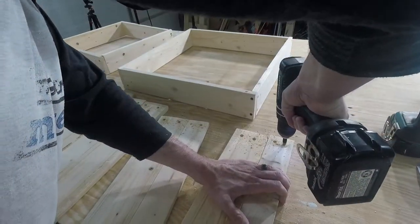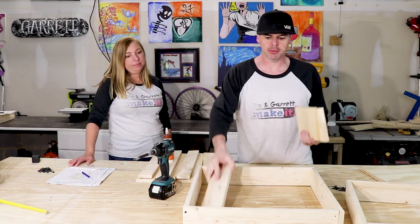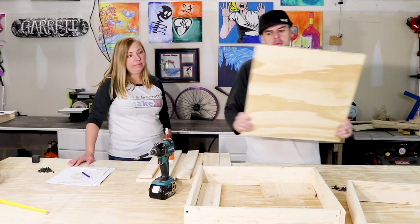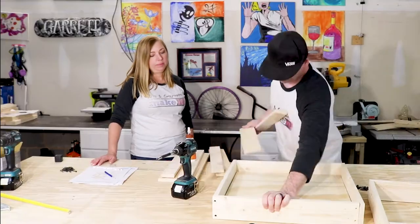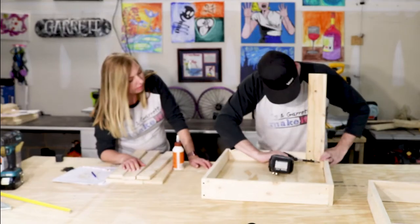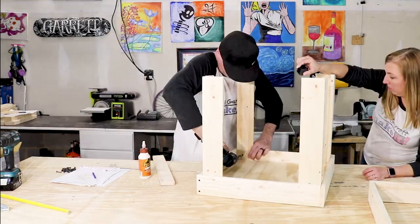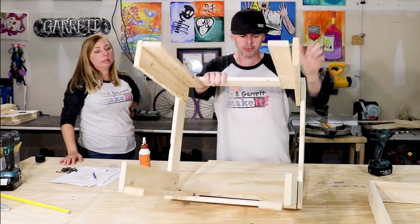Alright, stretchers are done. Now it's time to attach the legs to the top. We're going to put some scrap wood — about three-quarters of an inch thick — in the middle, then put our top in. It should be a tight fit so there'll be a little ledge for the cushion to sit on and it won't slide around. We're using some glue and 1.25 inch screws through those pilot holes to attach the top to the legs. Each leg is a wide board — a 4 inch board — and a narrow board — a 3 inch board — at each corner. Keep the 4 inch boards on the same side and the 3 inch boards on the same sides.